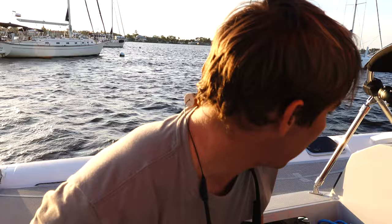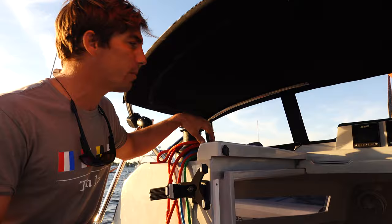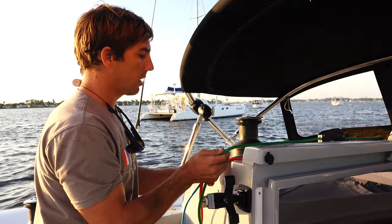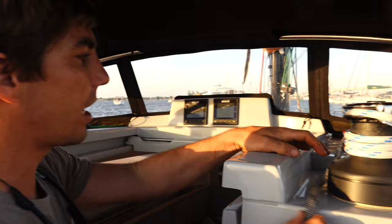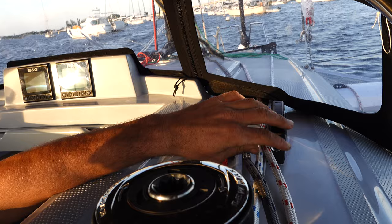Here is the cockpit of the boat. All the winches and lines are run through here if you want them to be. So we have all our lines here. Daggerboard down line, the screecher halyard, the jib halyard, they can all come right to this winch here. Daggerboard downline has a clutch, the other ones are clutched off on the mast. And then over on this side, you have the main halyard, the jib sheet, which is on the winch right now, and the daggerboard upline here. Jib sheet, main halyard, spinnaker halyard, and then the daggerboard upline.